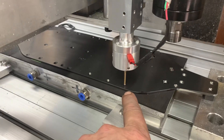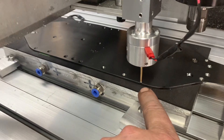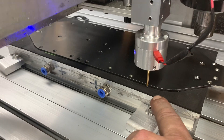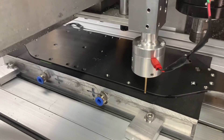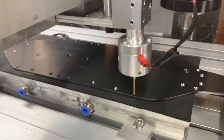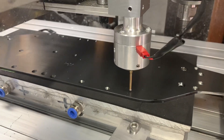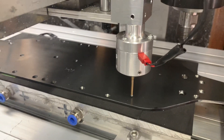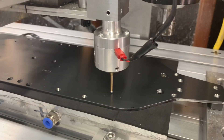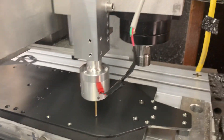One thing that's been mentioned to me — though I haven't confirmed it — is that if you're using a 1/8-inch probe you have to use a 1/8-inch end mill if you're going to cut directly from Centroid. I tend not to like using that small an end mill because it takes a long time. I'd rather just drop in a six millimeter end mill, rip the outside fast, then do a tool change and do all the holes.